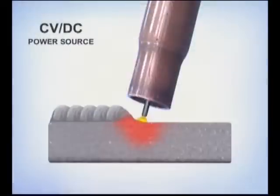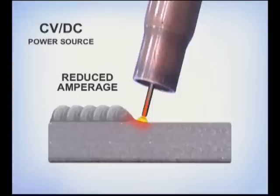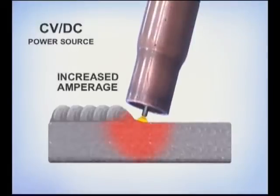During the weld, try to maintain a consistent wire extension. Even though the welding machine will maintain the arc, varying the position of the wire feed gun will affect the amount of heat at the weld. With a constant voltage type power source, longer electrode extensions allow the wire to preheat, reducing the amperage necessary to burn off the wire and cooling down the weld puddle. A shorter electrode extension increases the amperage, agitating the molten puddle. For a uniform penetration and a smooth weld bead, maintain a constant wire extension.